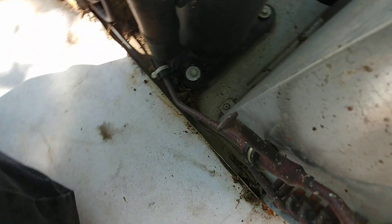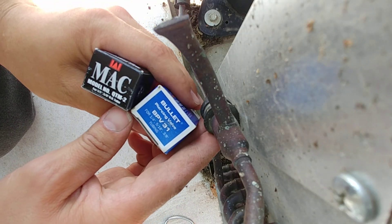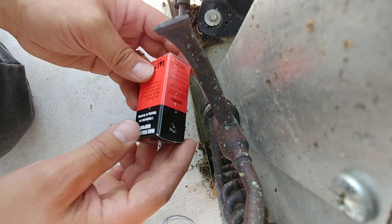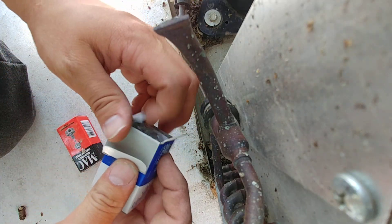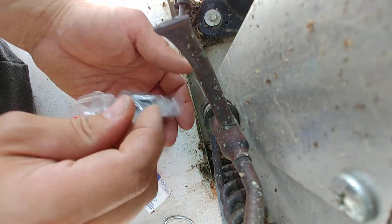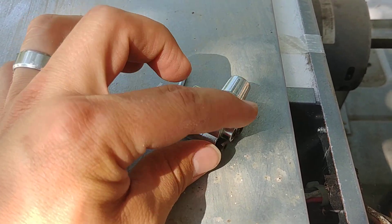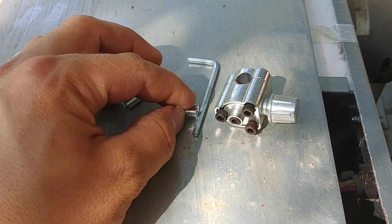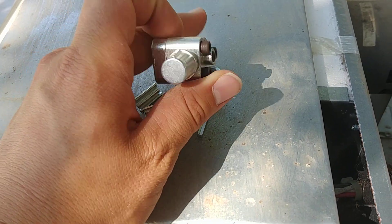I'll link in the description to these taps if you're looking for them. So here is what comes in these kits. There's a couple different sizes — we've got one that is for up to 3/8ths, 1/4 to 3/8ths, and this one is from 1/2 to 5/8ths. We're going to be using the smaller one. Open it up and show you what it comes with. Here's the tap itself. You take out these screws to get it apart and then you have two size reducers to reach the 1/4 and 5/16ths sizes it's compatible with, but today we're using it on 3/8ths so we won't have to change the size.